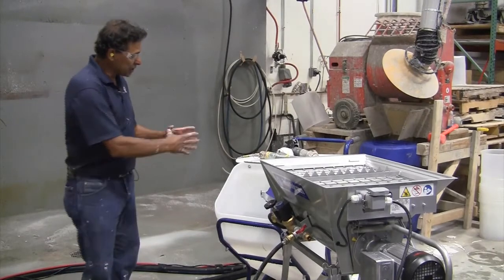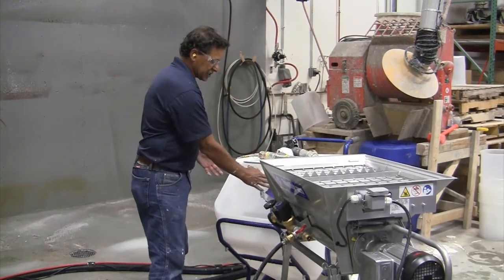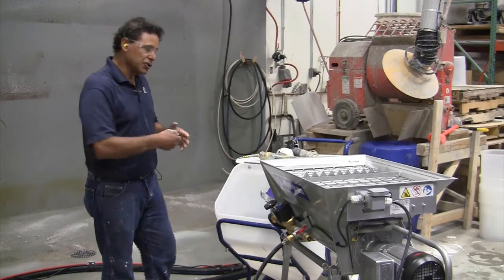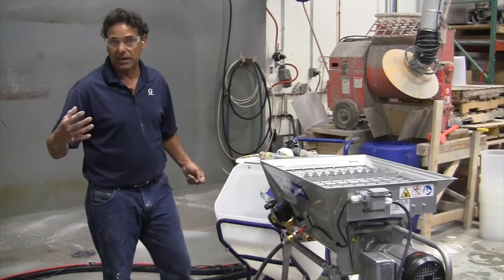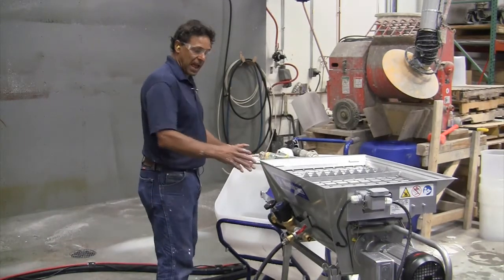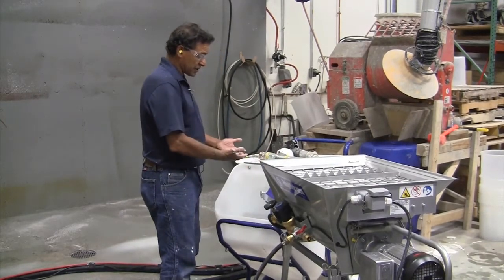With this particular application, we just want the bottom third of the hopper full. The reason for that is the dry material enters this 16-inch mixing chamber and goes out. Typically when you have a drum-type mixer — which you may see in the background — you mix with water, mix the material, then turn the blades off and let the material take an initial set. All concrete and cement products have an initial set period. Then you turn the blades back on and break the set. With this configuration, you do not have the ability to break the initial set, so it mixes here, drops in, and it'll set in the hopper if the hopper is entirely full.